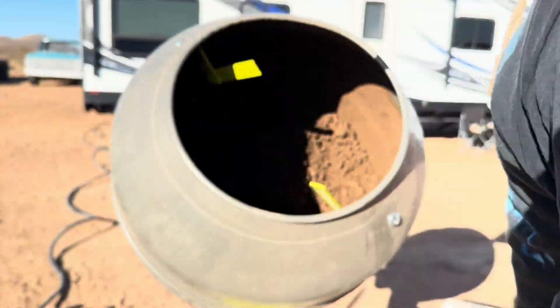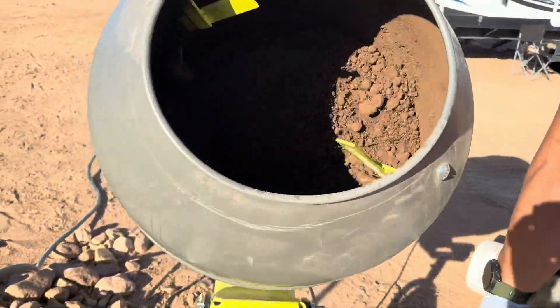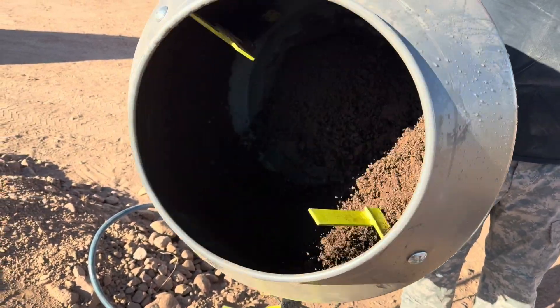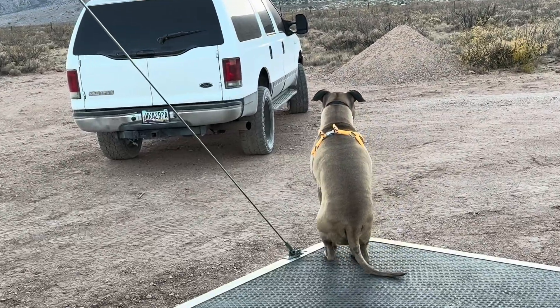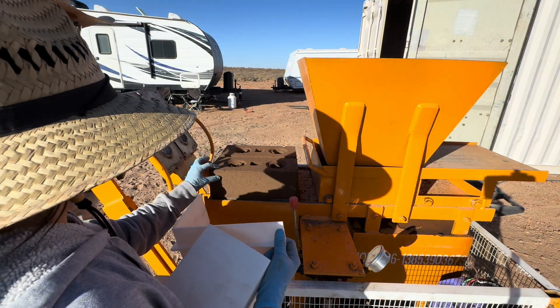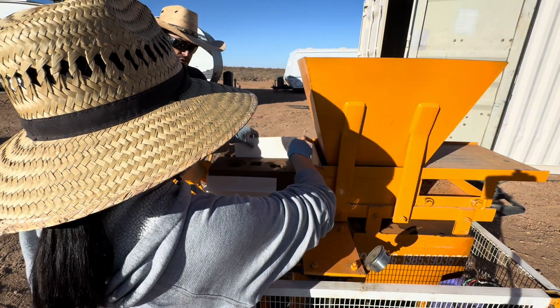We want to find the right mixture of soil and water content. I don't know what's causing us to fail right now — it could be not enough compression, too much water, too dry, not enough clay or sand, or just the wrong ratio for a perfect soil mix. We're going to try AB mix, and we also want to get our soil professionally tested instead of guessing our silt, clay, and sand ratios. It could come back showing we have way too much silt or sand.